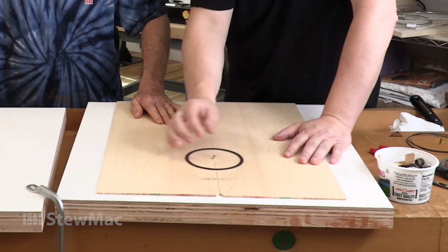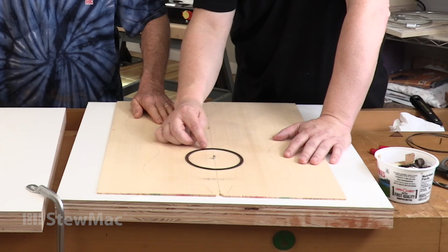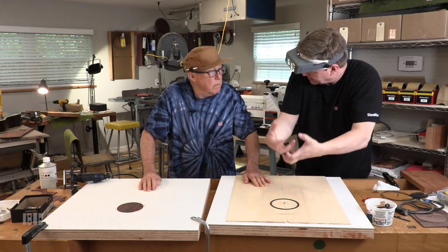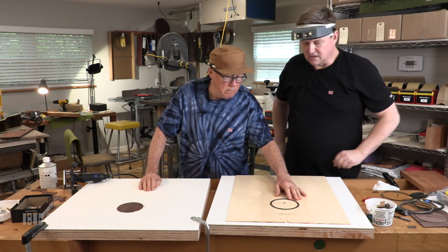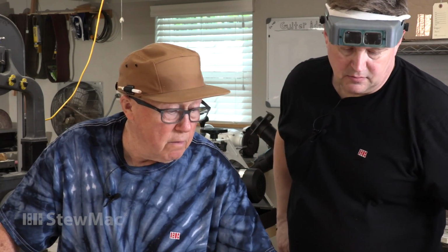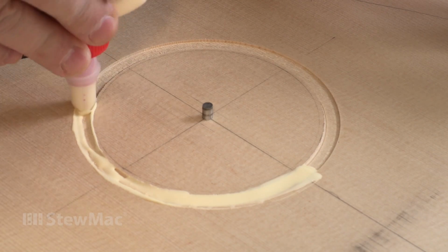And then after the shellac dries, put the pieces back in, and then right on top of the rosewood, put a little bit of number 10 super glue, and the capillary action will just pull it down underneath it, and it'll firm everything right up, and it'll be nice and snug and tight. My preferred method is to use Titebond if I can. But you can't here. But I can, and definitely here because it went in pretty easy.